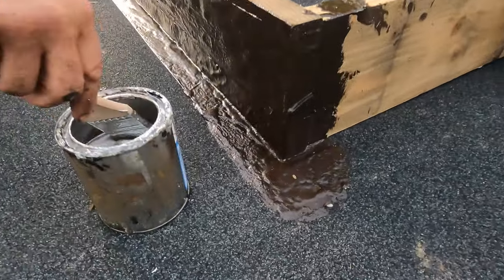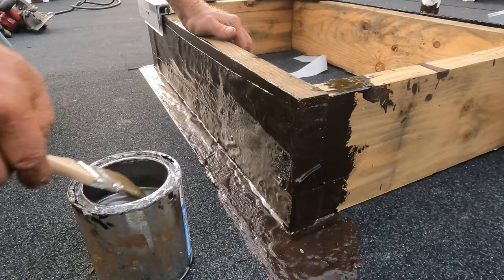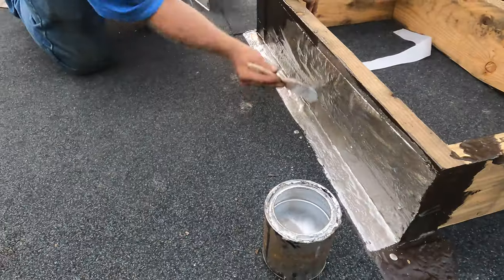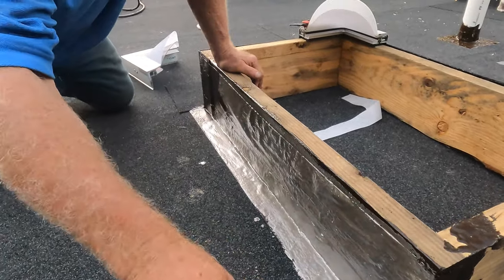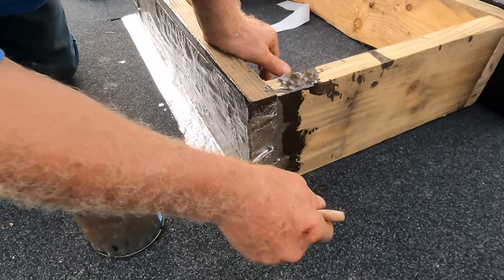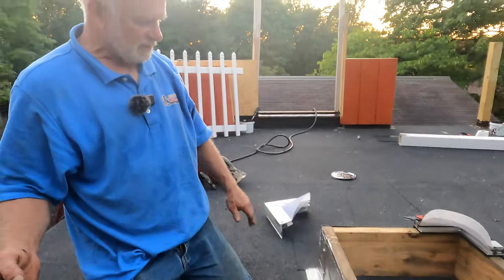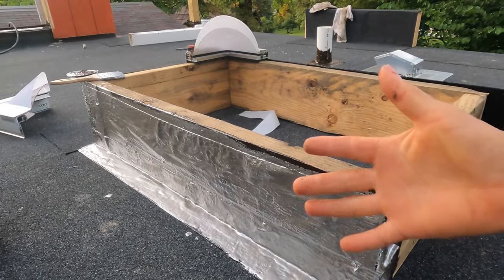All right, so after you did the flashing with Turbo Poly Seal, wherever you did it, it's a good policy to cover the Turbo Poly Seal with silver coat protection. Silver coat protection is very, very important. I did Turbo Poly Seal this morning, and this is dry already. Beautiful. It's nice, right? The most important thing is it protects and gives it a longer life. That will give extended life to the Turbo Poly Seal flashing. Very nice, because it reflects the heat, you know?